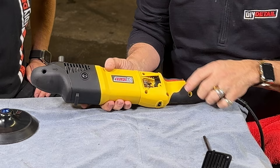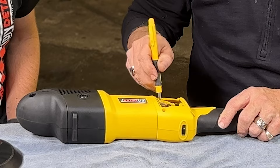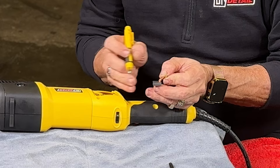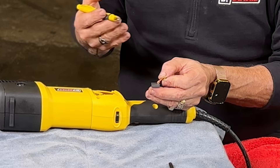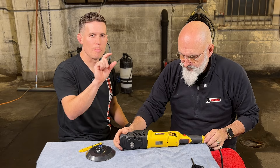The brushes are very simple and easy to change. You just move the spring off to the side and the brush comes up. These are carbon brushes — they press against the armature of the tool. As the tool spins, the brush wears down slowly while the spring pushes it in. If you're an everyday user, it might take you two years to get through a brush. We include a set of brushes with the machine. By the end of this video, this machine will be in pieces. And if you're curious how to service your machine, we have another video Ivan did with chapters and time codes, so you don't have to watch the whole thing — just look for the specific issue.